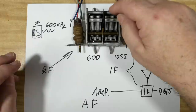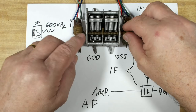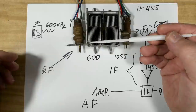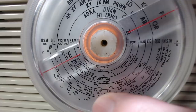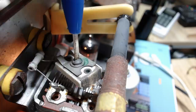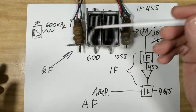We've got the pointer set up, we've got the low end of the oscillator set up, we've got the high end of the oscillator set up, and now we've got the low end of the radio frequency set up. All we have to do is put it up to 1500 again. There's a little trimmer capacitor on top of the radio tuner - we adjust that so it's exactly 455 away from the antenna, simply by turning the trimmer and getting peak output. I'll put the dial back on 1500, and I'll just rotate this trimmer to get the peak volume. You would have to say that's exactly where it was - so that's it.